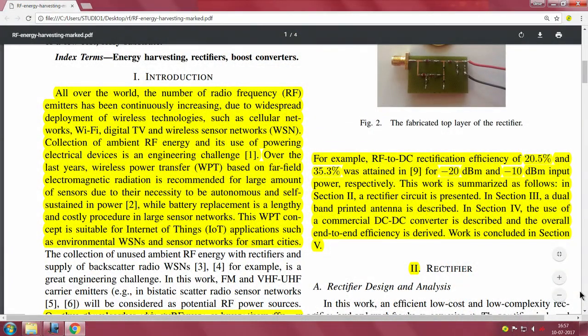So, he is also saying the same thing, and actually I showed you the quarter wave match that we did for our own chip, and that turned out to be quite successful in trying to harvest at minus 12 dBm and so on. So, that is a very critical step. The point is you should note that you should not just connect the antenna and say I am not able to harvest. It will not work unless you do proper impedance matching.